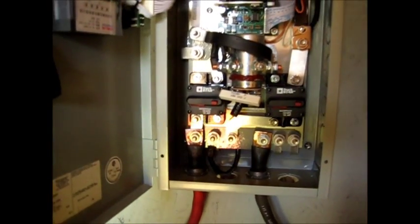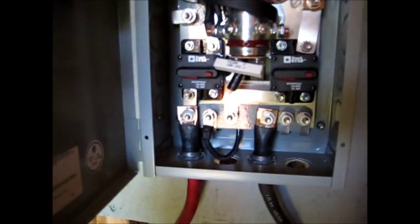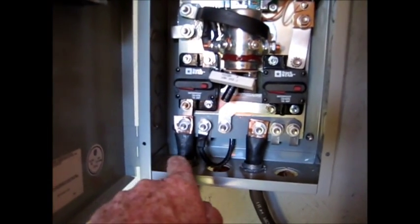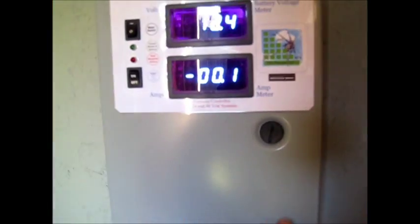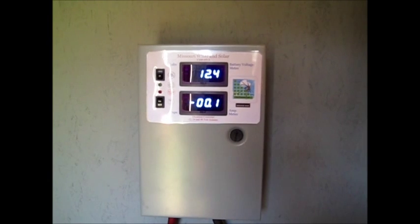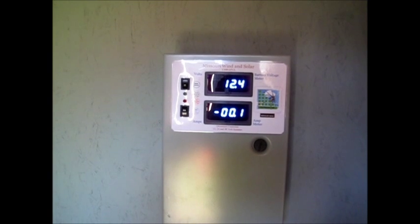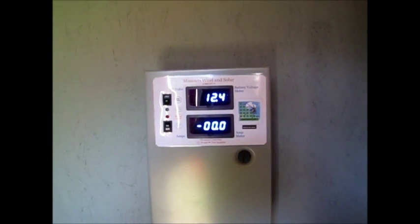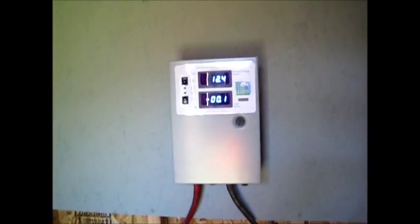It's all homemade connections — nice little setup. Jeff came up with a really nice little controller here. Can't wait to get everything hooked up. I've got it bypassed — they say to bypass this one lug, take it from here. It was over here originally, moved it over to here, and that way when I get the solar panels hooked up it will show the amps of the solar panels. Those batteries have been sitting out for almost two and a half weeks on a piece of wood out there behind where I started building this shed, and they're still sitting at 12.40, so it's not too bad.